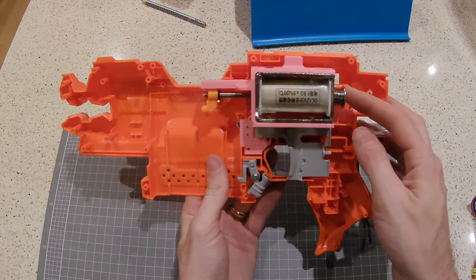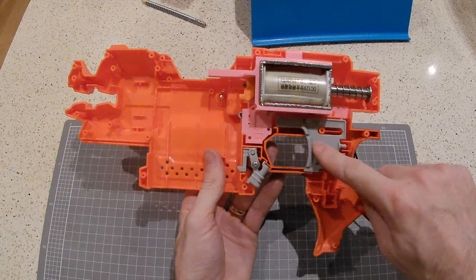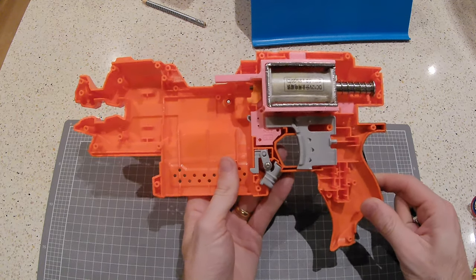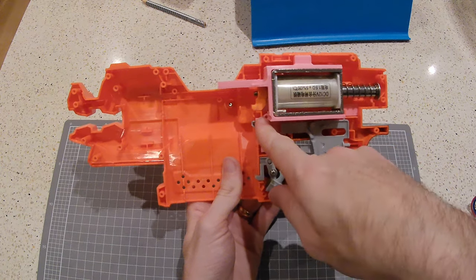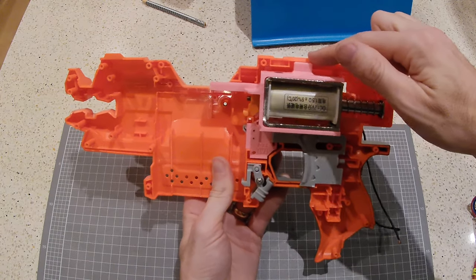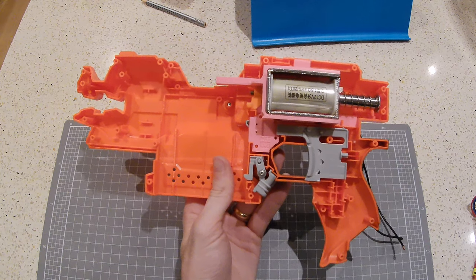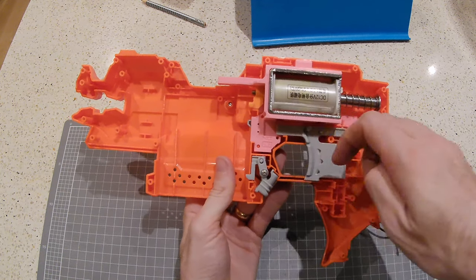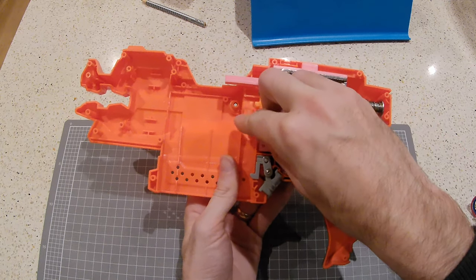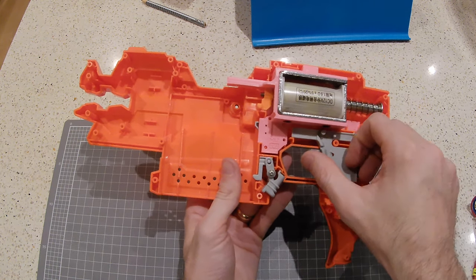There are a number of different things going on here. You've got the cage which holds it in place, but you also notice this component down here which provides somewhere for the trigger to slide against. It also provides some mechanical strength in the mounting — you put one screw through here and one through there and that will hold it in place really well. The top part interfaces against the shell, and the bottom structure keeps it from rattling. These two holes here allow you to mount one of these super micro switches, which is smaller than normal, for a dual stage trigger if that's what you're looking for — you don't have to use it, but it's there if you do.